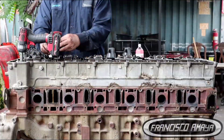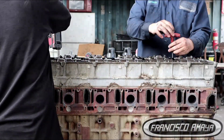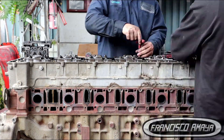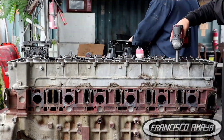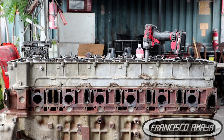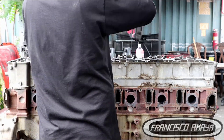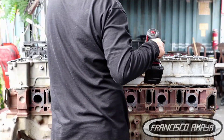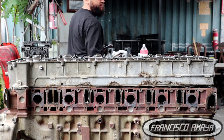The reason is that when you replace a crankshaft, the best practice is to do a full overhaul. You are putting in the main piece of the engine — the crankshaft — and if you are going to reuse all the old components, the repair is not going to be the best. So whether this crankshaft is used or new, if you are doing a crankshaft replacement you have to remove all these components so that way you get a full engine build and a guarantee that the engine is going to work perfectly.